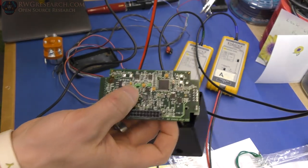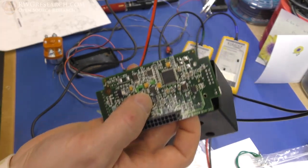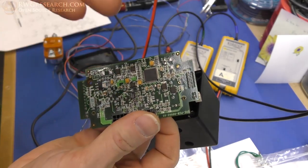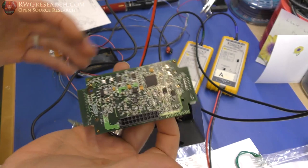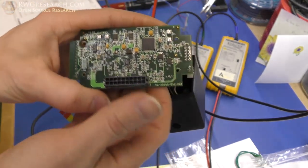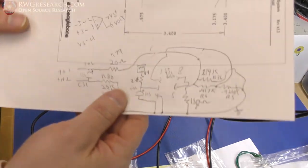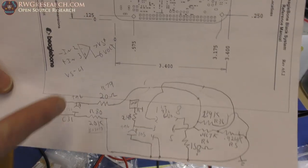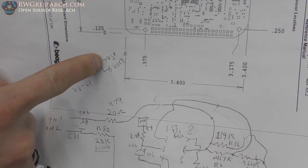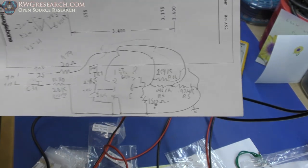A lot of op amps, apparently, I'm not 100% sure about this, don't drive themselves all the way from max to min. Because the supply voltage on this is 3.3 volts, they wanted to drive it from rail to rail. Now, what I'm showing you today is a little bit different, but that's how they did it, and it works. They don't have a resistor across the output going to the actual controller, but I do. So here's the op amp, pins 2 and 3, 7 is power, 6 is out. That's your 1, 2, 3, 4, 5, 6, 7, 8. This is the op amp chip.